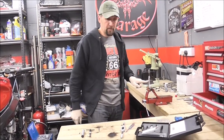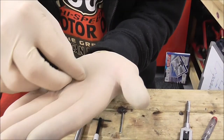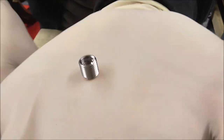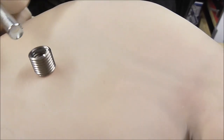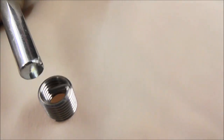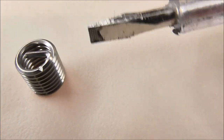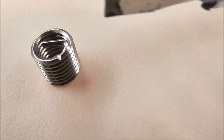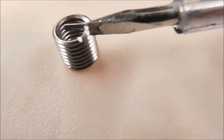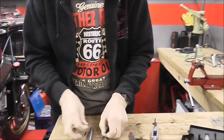So what we need to do is put a thread into that, and this is how it works. This is the little thread repair itself — that screws into the hole we've just cut. It's got this little wire tang that comes across the middle of the hole, and we use that to screw it in — that's its applicator. And if you come around this side here, there's a little tiny dent, a little tiny indentation. That's a break-off point. So when we've finished applying this, we snap this little piece off. I'll show you once it's done.